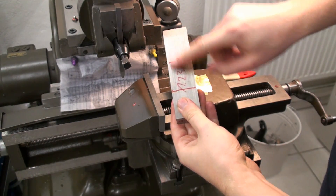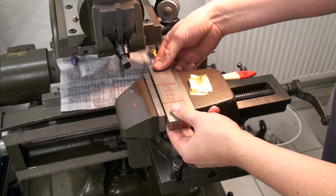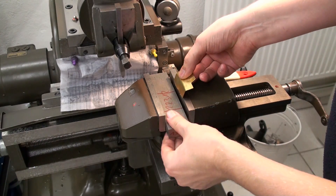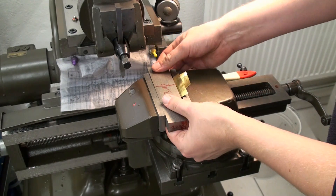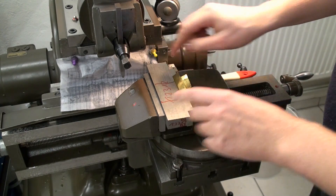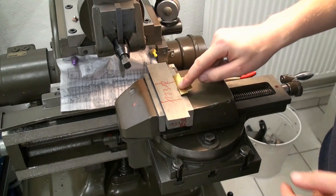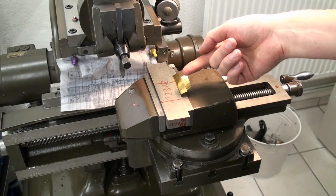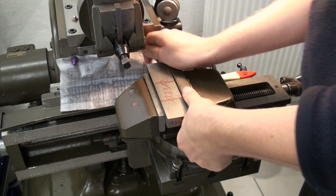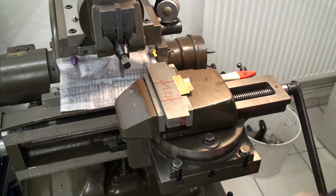The raw material is just a solid piece of steel and is not parallel. I let one side rest against the jaw and put some shims in the center of the other side — just brass shim stock — so when I clamp it I get a three-point contact. The part sits against the fixed jaw and I have a push point on the movable jaw, so the part can't move on me. I just bend the shim stock a bit down and clamp everything.